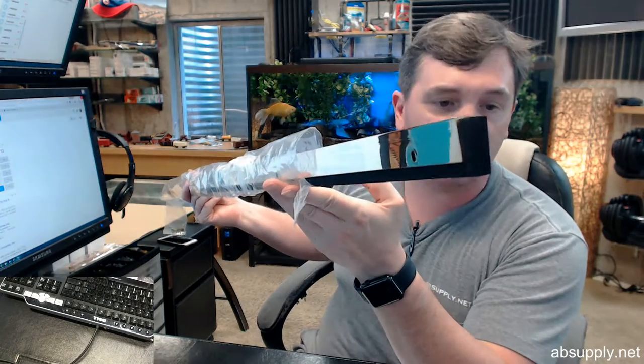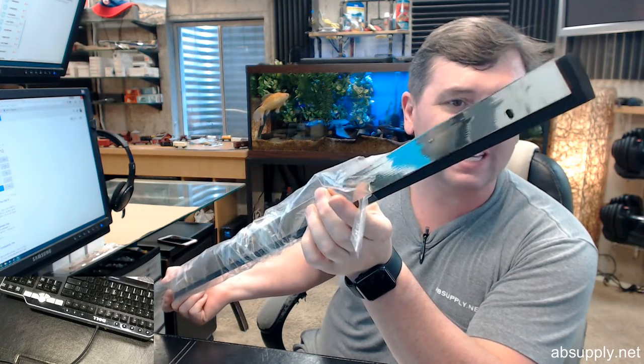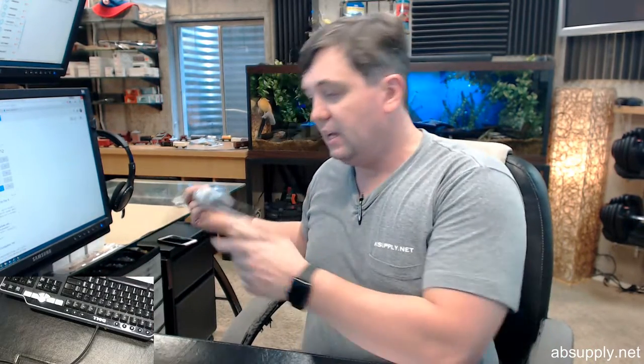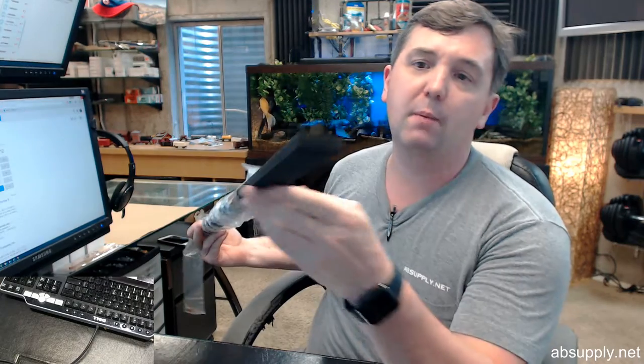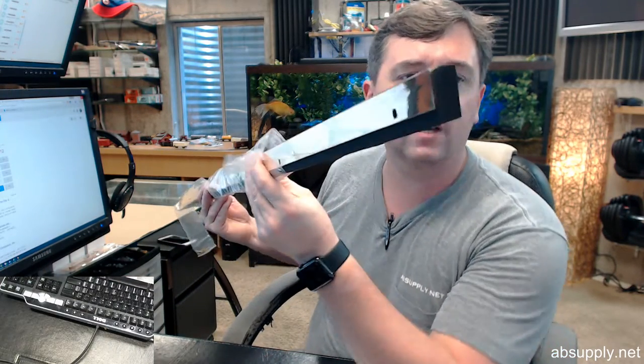This also has a clear lacquer over it, which is going to give it its highly reflective, shiny appearance. You could order it unlacquered because that's a process, but if you want the polished brass to last longer rather than less, you'll want the lacquer on there. Eventually, it being a solid brass base material, the lacquer will fatigue and the item will begin to age, as brass will when it's exposed. That is, of course, just the nature of what the material is, and there's no way to really permanently cure that sort of problem. You'll have that sort of fatigue and failure on lock sets, on door knockers, on kick plates, etc. So it's no better or no worse than any other piece of hardware.